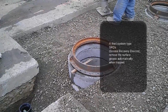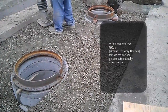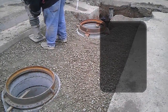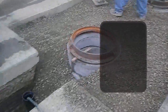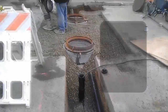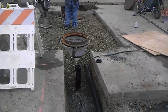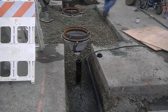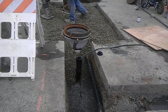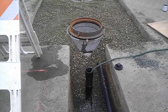When you're working on the installation of a grease interceptor, these units need to have a certain depth. For example, on this one over here it's just about 16 inches below, so it's a traffic-graded grease interceptor. The rings are the only things that will be at finished grade. The base rock being placed above the grease interceptor will be compacted to maintain enough compaction for the road that is going to be installed above.